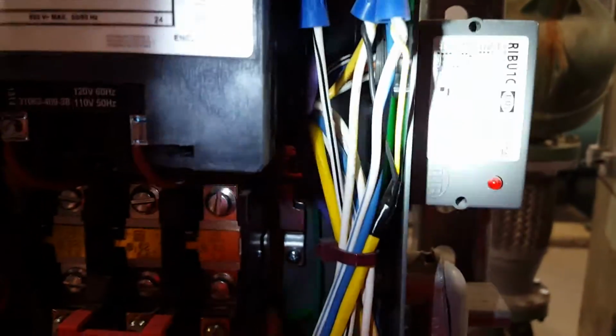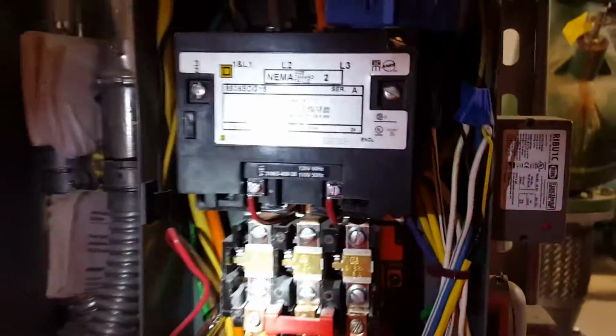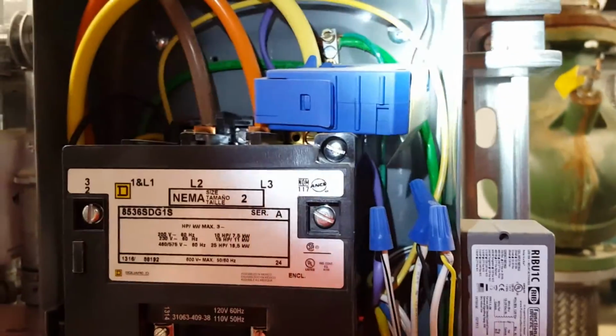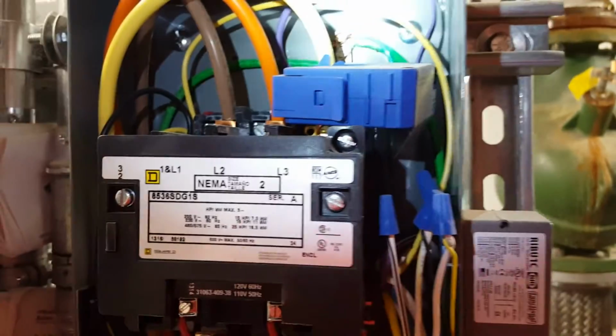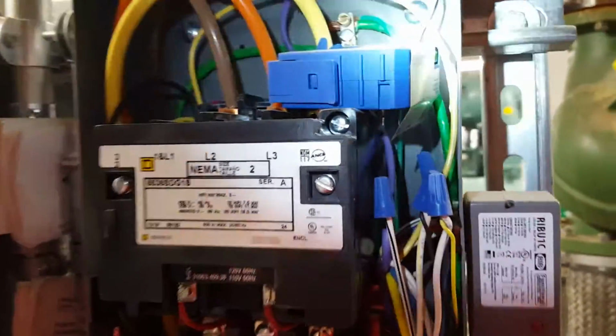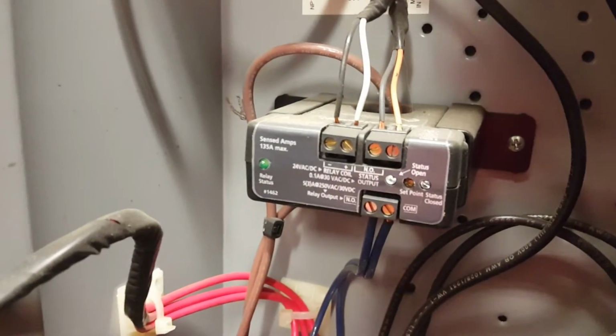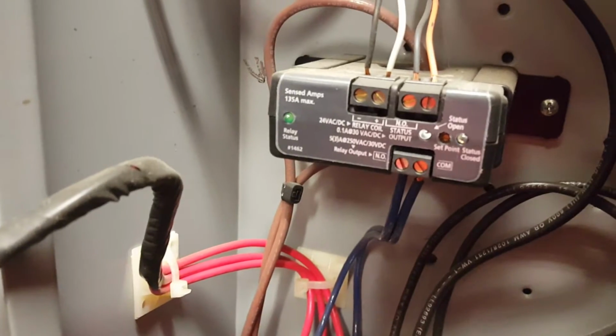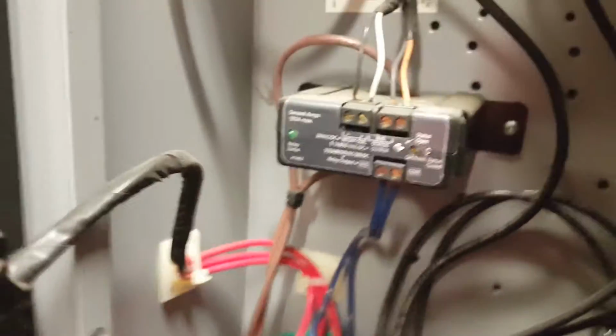Here we have this motor starter controlled by an additional relay. You can see the connections here from the controller, and the controller will fire this relay. Then this relay will start the motor starter itself, will pull the starter in. We'll then see flow of current through the CT. The status will go on for this pump on the system because those contacts will close. This type here will not only determine status if it sees current flow, but acts as the control relay.